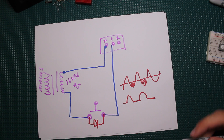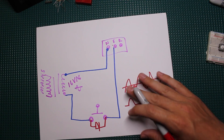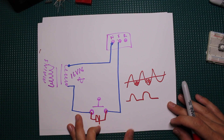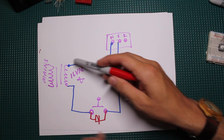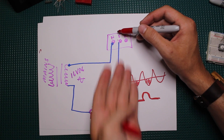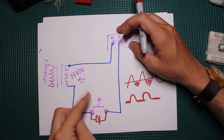When you update to the new electronic doorbells that play a melody when you press the button, here's what the diode is for. If you're using the same wiring from an older installation, when you press the button and let go, you lose power to the doorbell, so you can't play a melody or a song. The purpose of the diode is to provide continuous power to the doorbell — it provides a half-wave rectified AC signal, which you can then filter to create a nice DC supply for the microcontroller or processor in your doorbell.